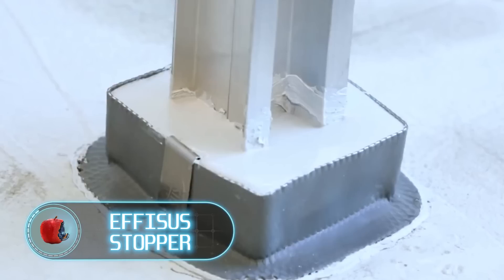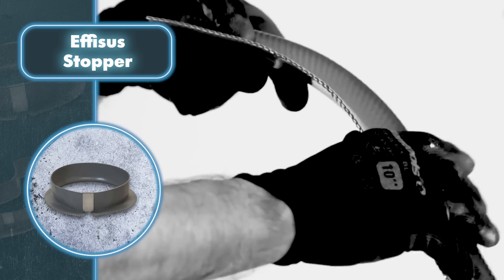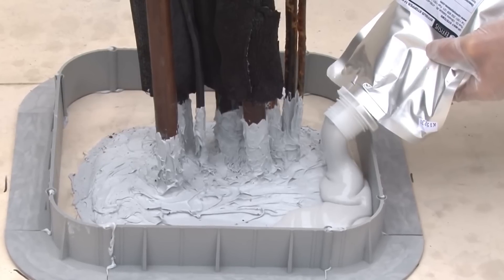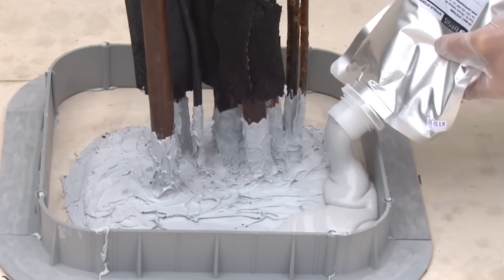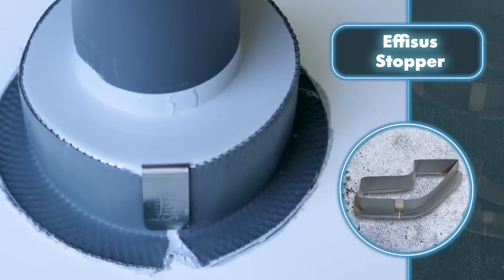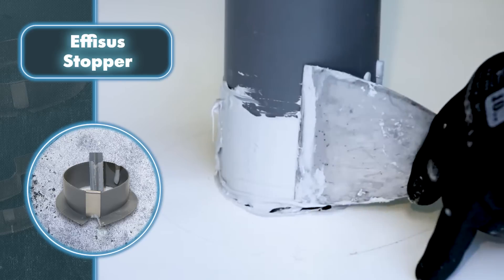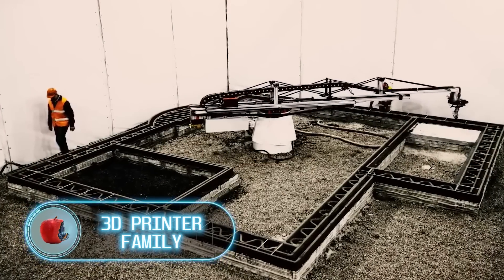Ephesus Stopper: sealing flat roofs or facades is sometimes challenging, but this system can make the job a lot easier. Reliable sealing and stability, simple and fast installation, and versatility are the main advantages of this solution. Sealing is ensured with a special sealant that creates a 100% watertight seal, and the entire system is resistant to ultraviolet and ozone. The straightforward installation process is made possible by the solution's flexible design, allowing it to be easily customized for different applications and eliminating the requirement for mechanical fasteners. The system is versatile thanks to its compatibility with a wide range of common roof types, including asphalt membranes, PVC, and metal, and can also be employed on sloping metal roofs.